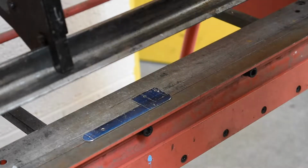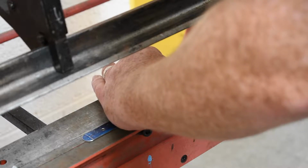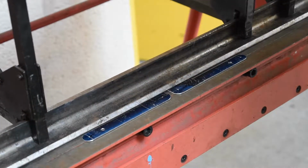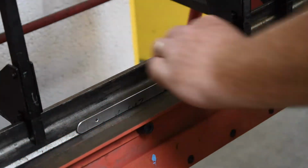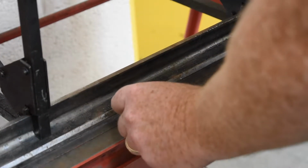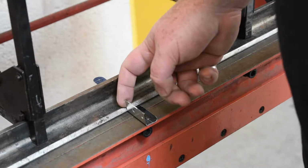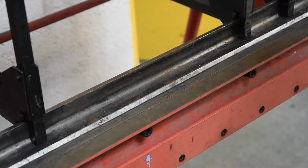So line up your pieces carefully as always. Clamp down once you're happy and bend both of those 90. So that's our first section. Now we need to bend at this line here up 60, but we can't do that now, because if we clamp in here and try and bend it, this piece of metal will crash into this and damage the edge. So what we're going to do is use the edges of the bending bar. So I'm going to reset to 60 now.